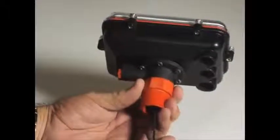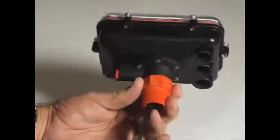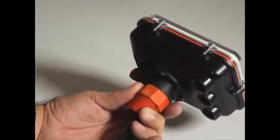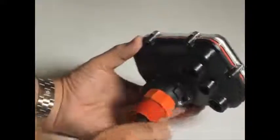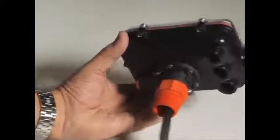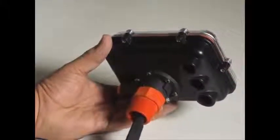And here is an F60 with its lid on. It's got a paddle fitted to it that's suitable for pipes in the order of 80mm to 100mm in diameter. As you can see, it's a pretty robust device, extremely weather tight, extremely solidly built, made to last for years and years. The electronics in it are designed to tolerate very wide variations in voltage and supply fluctuations, voltage spikes and that type of thing.